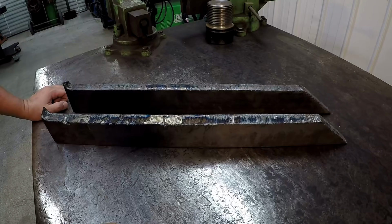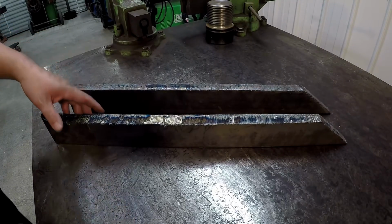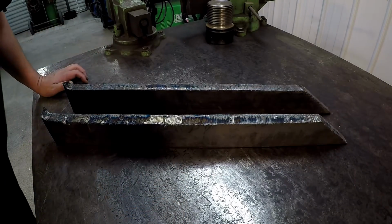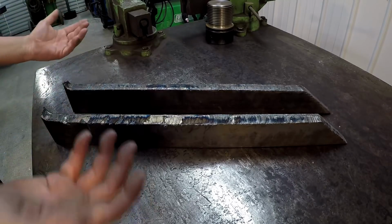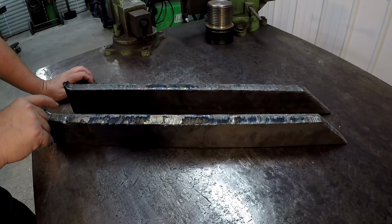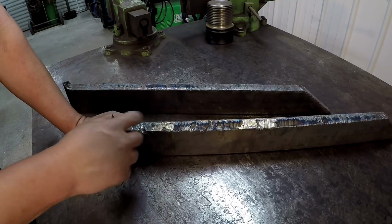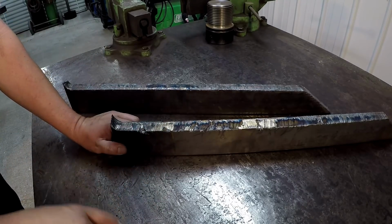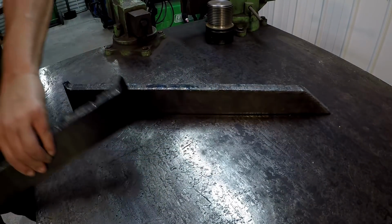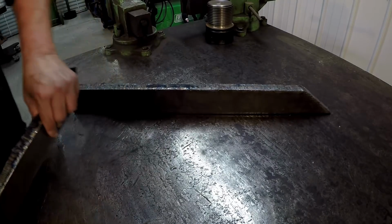What he's wanting to do is pretty much make a set of parallels that you would bolt to your workbench that overhang outside the table, that you could set a shaft and a flange housing down on. Have these cut, and right here in the back area, drill one or two holes, probably for a cap head bolt, and then have the table drilled and tapped so that they can bolt to the table and hang out, and then you can hang work pieces out over these right here.